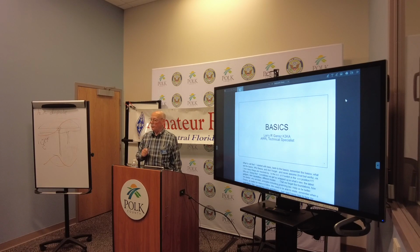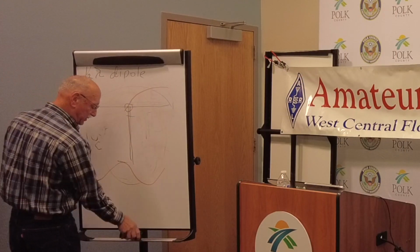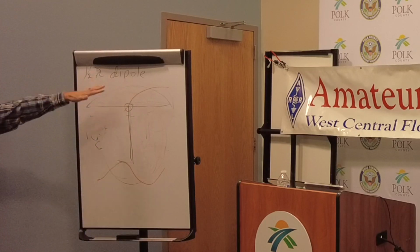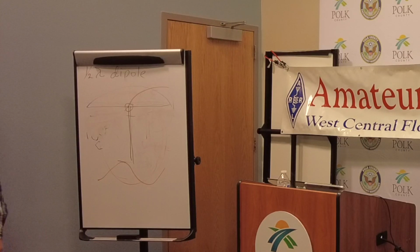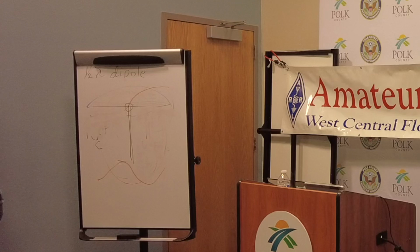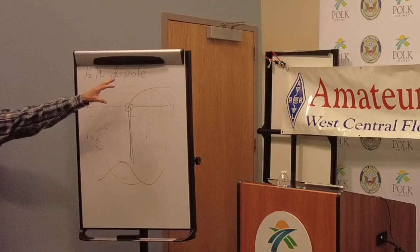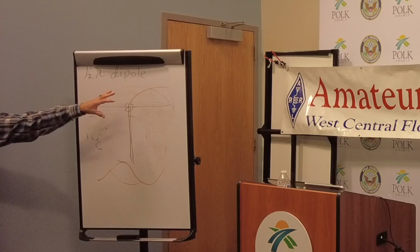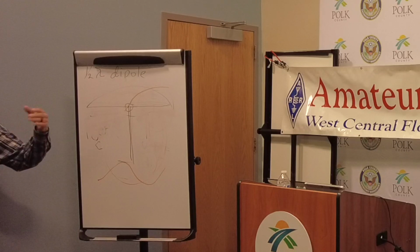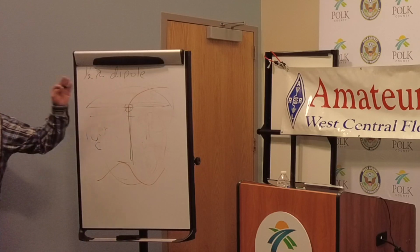But how are we coupling that to the transmitter? This is part of one of the further statements on down the line, but it's relevant, because we said this was around 75 ohms at resonance. Coax at 70 instead of 50? Why do they always try and sell you the 50? Because 50 is the most common one made. So it would work better if you switched it out for 70? If you could find it. Unfortunately, most of the 70 ohm coax comes from cable TV, and it doesn't typically handle the power well, but it's easier to make. There's more of it made. 75 ohm coax is just very expensive.